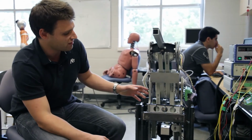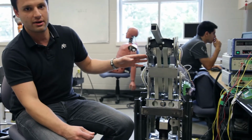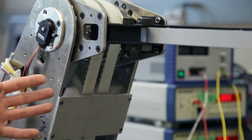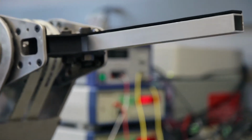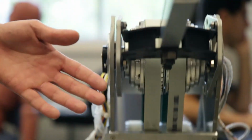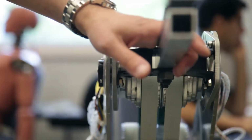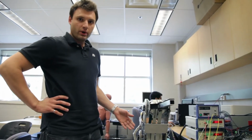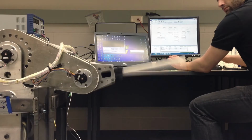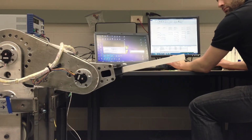In this way, we can drive both clockwise and counterclockwise torque to each of the joints independently and simultaneously without changing the speed or direction of the motor. This arrangement allows us to locate the motor at the base of the robot, which reduces the flying weight of the robotic arm. The DASA configuration with antagonistic magnetorheological clutches allows us to achieve performance levels not attainable by conventional servo motors. The actuation is completely compliant, making it safe for human-robot interaction.